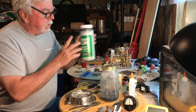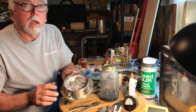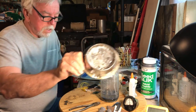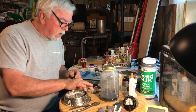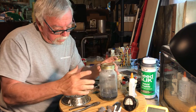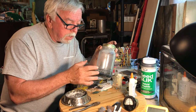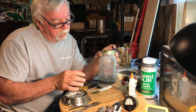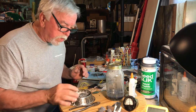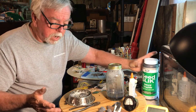Let me give you some information about the solid electrolyte. Here's what it looks like. The solid electrolyte — I made it by cooking it. The majority of it is made from water glass; I made this the regular way to make water glass. I cooked it quite a long time and it's been sitting for quite a long time — it's very strong. Then I cooked it down along with natural graphite. You need graphite for the conductivity.